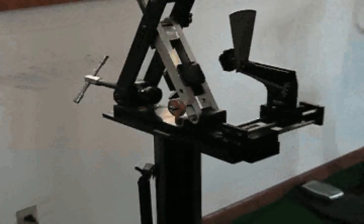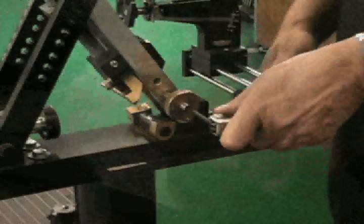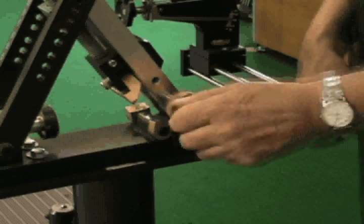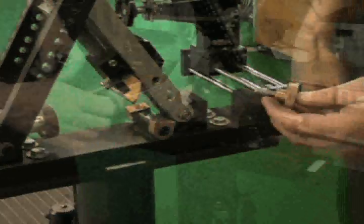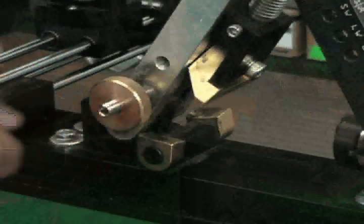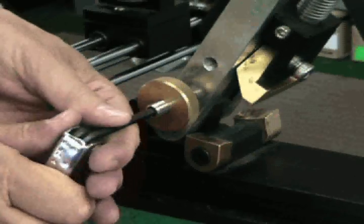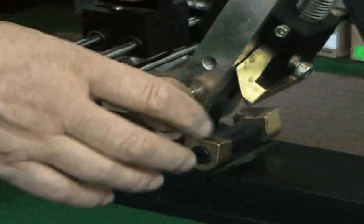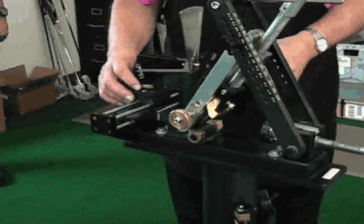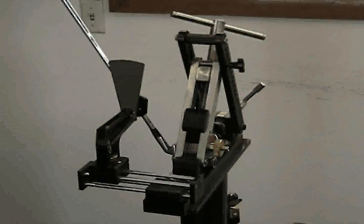The only part of the Maltby designed bending machine that requires disassembly for use with left-handed clubs is the brass toe stop. To set the bending machine up for left-handed clubs, use an Allen wrench to loosen and remove the toe stop bolt with the brass toe stop disc attached. Move to the opposite side of the machine and reinsert into the toe stop receptacle. Approximately eight turns of the bolt should be sufficient to position the bolt securely into the bracket. Adjust the toe stop disc as needed. The sliding protractor assembly will simply slide to the left-hand measuring side of the machine — no disassembly is required.